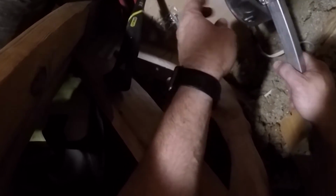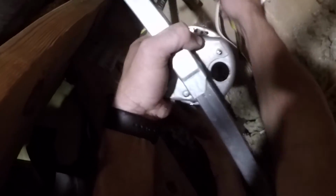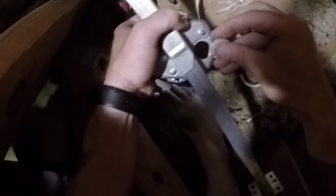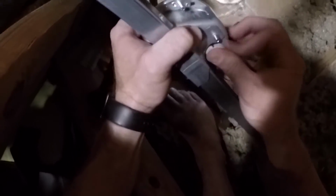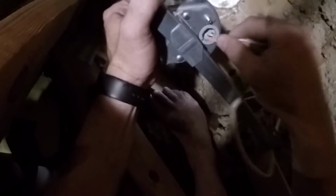That's going to let you line that box up exactly with the opening. You're going to be able to now put your wire through. Knock one of those out. Put your piece in. There. Your wiring will push through it.